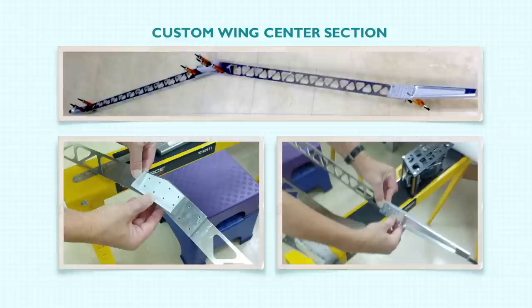This is some pictures of the custom wing center section structure put together by Leslie. It's an aluminum structure — an aluminum rib that is water cut. There's a joiner plate with fasteners on each side, and then there's a machined spar tip out here. We kept the original spar wing design on the outer panel so we didn't have to modify it. The wing center section interfaces to the airplane as if it were a stock wing, so the airplane plugs together.